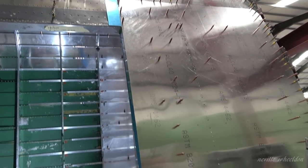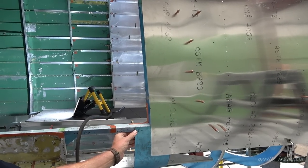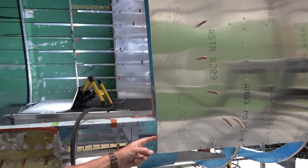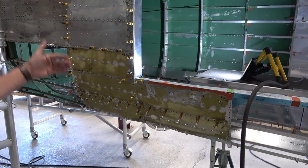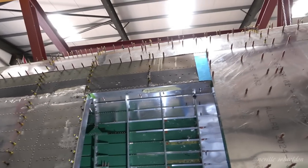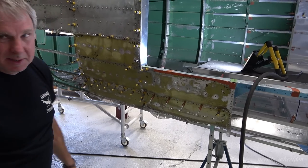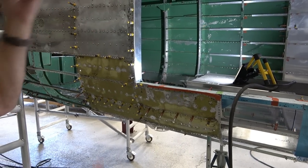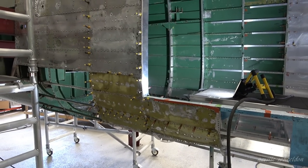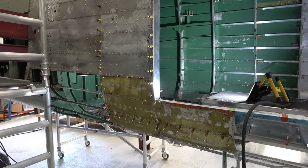The first C-section is actually 14 gauge, which is just over two millimetres thick. It's a triple skin — you've got that C-section, and this yellow metal here is the other C-section that goes right around the door. You end up with the outer skin, an inner reinforcing, and sandwiched between them is another piece of metal — effectively like a window frame. Obviously because they've cut such a large section out of this fuselage, they've had to reinforce it.